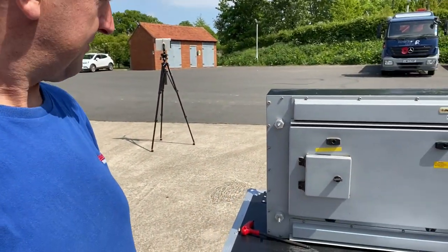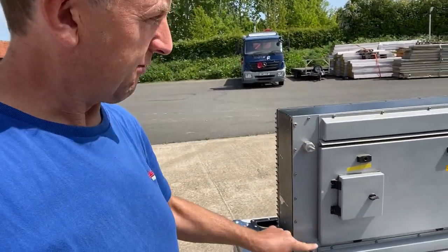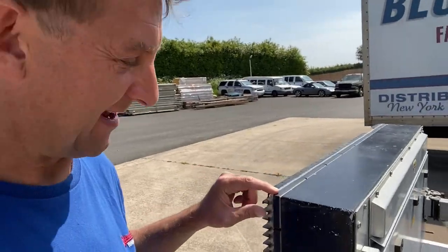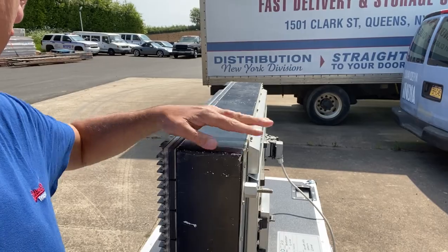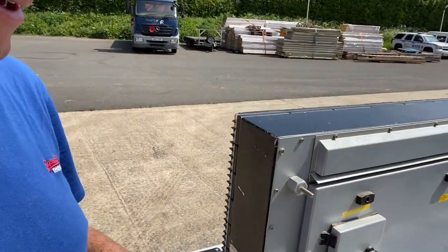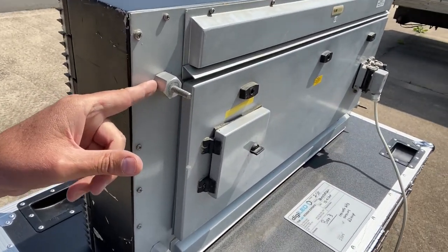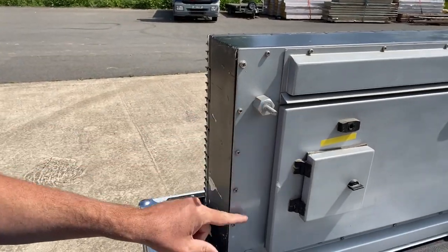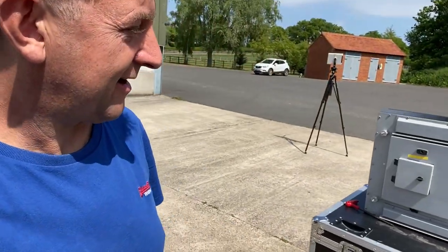The mounting points of the panel, these are, I guess they're M8 bolts. Four of these in the corners. These were notorious back in the day for leaking. All the other seals on the cabinet, the foam rubber seals here, the foam rubber seal between the box and the back plate, these were all fine. But when these mounting holes were drilled into the panel, a slight design omission was that no gasket was placed here, and water used to creep in here, and yeah, let's just say the inside of these panels weren't particularly dry.